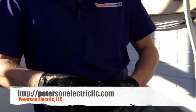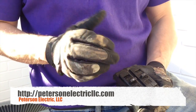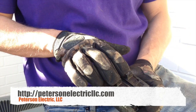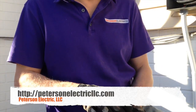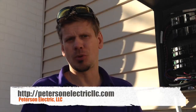Here was the dryer — it was all single pole. Anytime you're going to share, whether it's a feeder or a branch circuit, and you're sharing that neutral, both of these have to simultaneously disconnect. And if it's not feeding a neutral — for instance, like a baseboard heater or water heater — you still have to have a two-pole tie here, or a three-pole tie if it's a three-pole breaker.